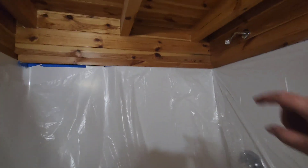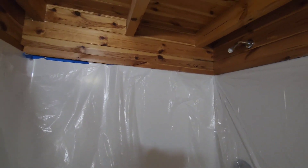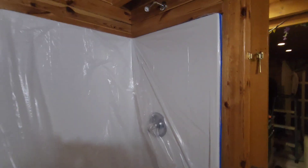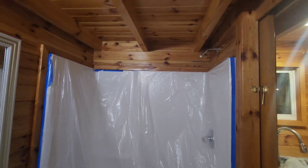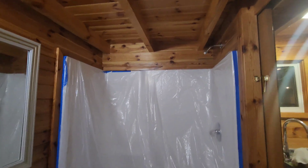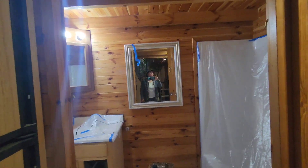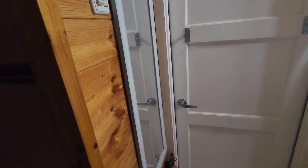That's exactly why I'm thinking about punching another hole right there and putting another 12V fan — maybe on a separate battery pack. It only has that one fan right there, but it really needs something up in this corner because that spot is not going to get any ventilation. If I put a small exhaust fan up there going out the wall I could eliminate a lot of the steam issue right in the shower space. Knowing me I'll probably just pull the curtains on the front of the house and leave it open, which will help a lot to prevent water damage. But it's nice to have options.